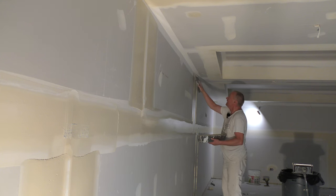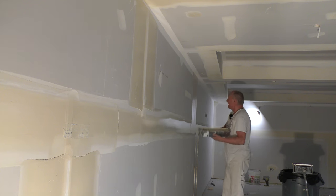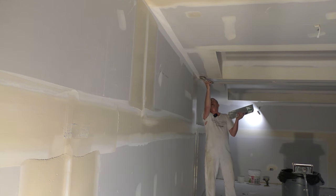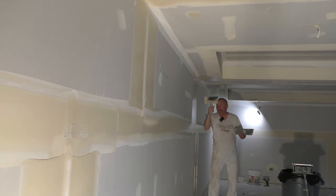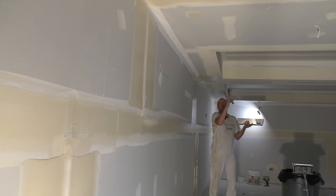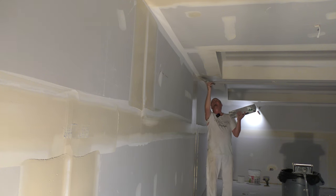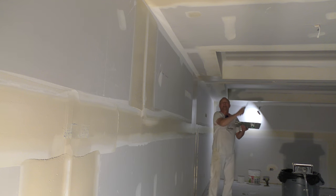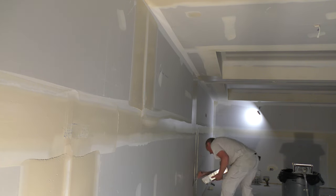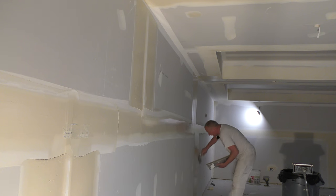Had I let this stuff set and come back the next day to cross it off after it was dry, I would do this much differently — I would just mud it up and wipe it out. But since it's all wet I have to coat it in. All I'm really doing is using the 10 box to get my mud up there quicker. If I wanted to get my mud up there slower I'd do it all by hand, but I'd never get out of here. No offense to hand taper guys — I think you guys are phenomenal. I've been running tools since 1976, so I'm a tool guy.